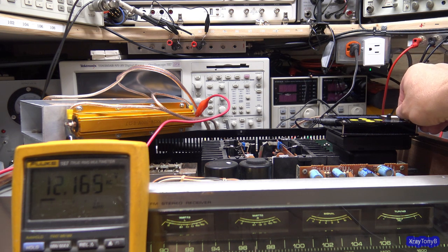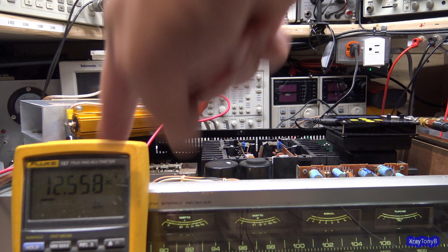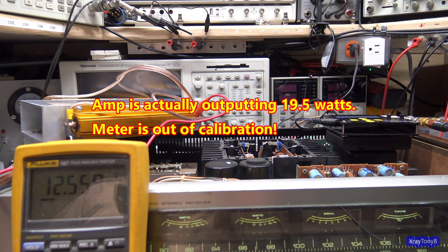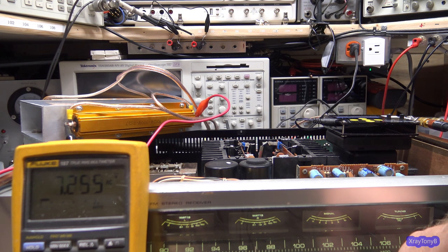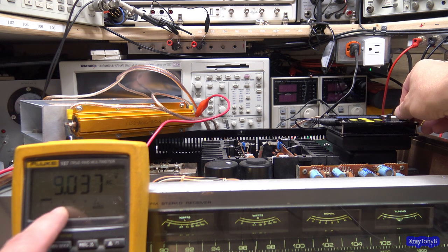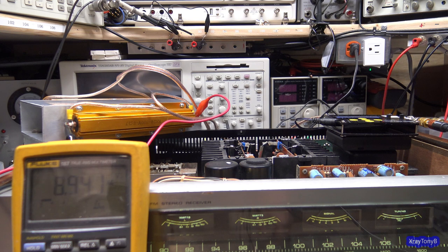And you can see that's not set right. It's saying 10 watts and they're saying 12.5 volts. And we want 8.9 volts. So that means it's set wrong. What we want to do is take this down to about 8.9 volts. I'm going to just measure it till it says just about 8.9 something volts. There we go. That's pretty close, right? 8.94. And then all I'm going to do, now that I know I'm putting out 10 watts into that resistor,